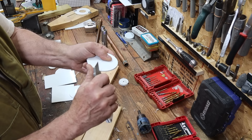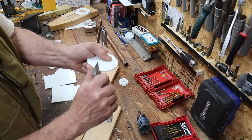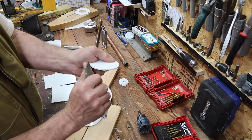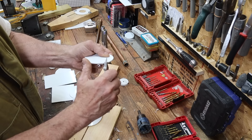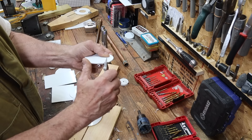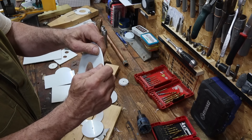I like to use just a utility knife — you scrape it along like that. It gives it a little round over and gets rid of the roughness. This is easy material to work with, this PVC. Do that on both sides. You could take a file if you wanted. That outside edge needs to be cleaned up. I have done it here and it just feels and looks really good. It's going to require some attention.